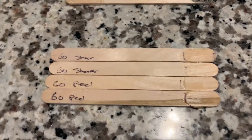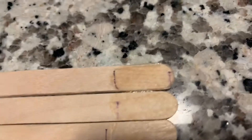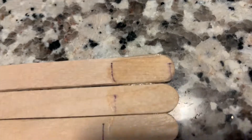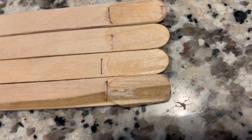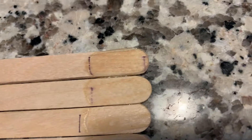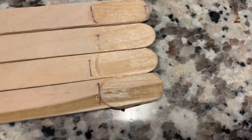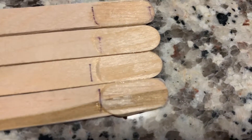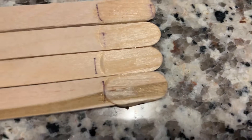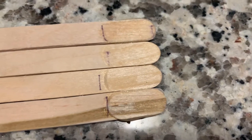Now we get into a very popular one-hour, 60-minute epoxy — again, shear and peel tests. On the shear test, it completely let go and all the wood grains are intact. On the peel test, there was just a little bit in the bottom left corner, but otherwise the actual adhesive let go.